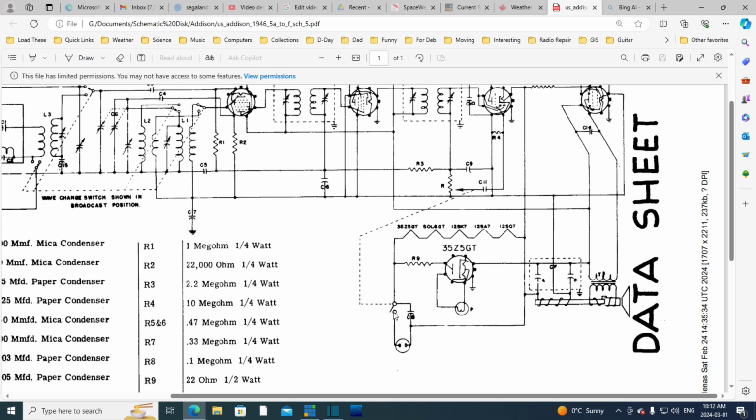So in this radio, when the switch is open, nothing is able to conduct current in the radio. Some of these radios, this capacitor will be on the other side of the switch. And as long as you plug in the radio, the capacitor is feeling 120 volts day and night. So probably not the best thing in these old radios. Keep that in mind if you have an old tube radio, that you just don't leave it plugged in when you're not using it, just in case.